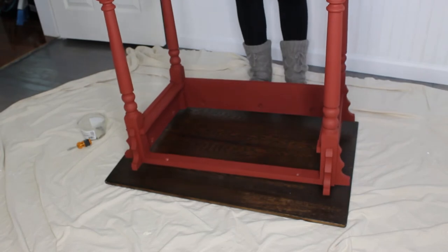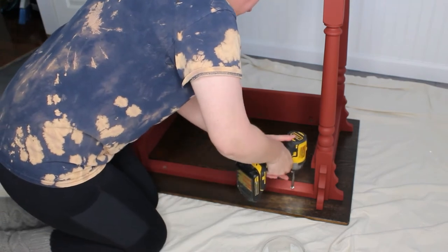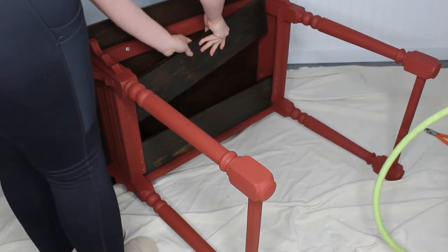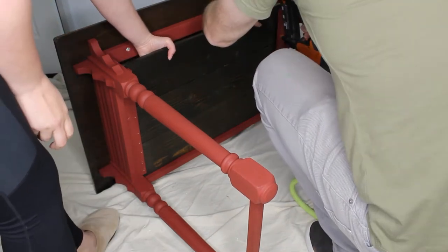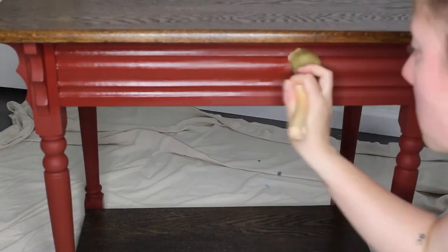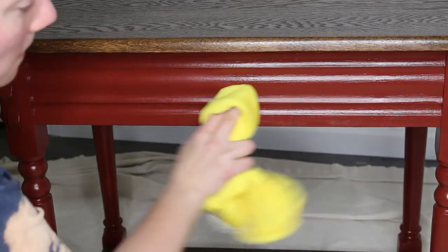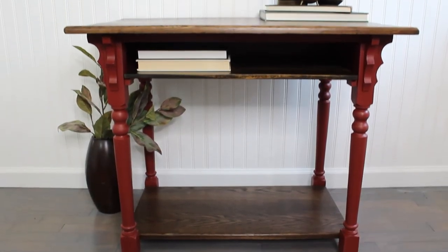Once all my paint and everything dried, I was ready to put it back together. I started by screwing on the top — I know that seems a bit backwards, but the way the screws were angled I wouldn't be able to get them in if I put the shelves in first. I recruited my boyfriend to help put the shelves in and we nailed them in with the nail gun. I waited to seal this piece until after everything was put back together, just in case I had any scratches to touch up. I'm using Dixie Belle's Big Mama's Butter, applying it with my Jolie Pointed Wax Brush. Using a clean microfiber cloth, I just wiped back any excess. And here is the final product.